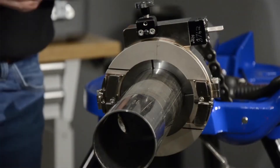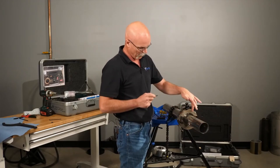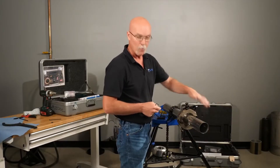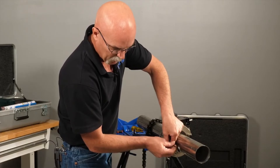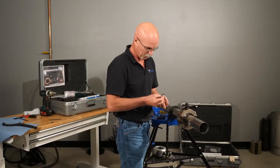Grab our tool bit. When you have thin schedule pipe you can just run one tool bit to sever it off — straight severing. You can completely remove your other tool block and just run the one, that way you have a backup spare part. If you're running a heavier wall, you have to have two different tool bits — one to lead and one to trail — to cut relief for each other.